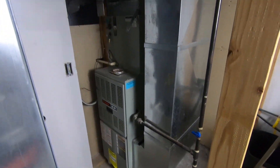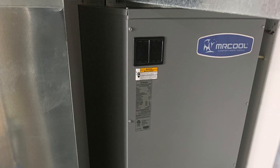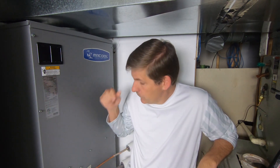Right on this side of the room you can see that's my old gas furnace. And there you can see the Mr. Cool Universal. Once we got the air handler installed inside the house, we just had to go ahead and mount the condenser outside, connect the refrigerant lines to the condenser, hook up the electric both to this unit and to the condenser outside using the existing electrical connection from the old setup, hook up the thermostat, and turn it on to see how it would work.